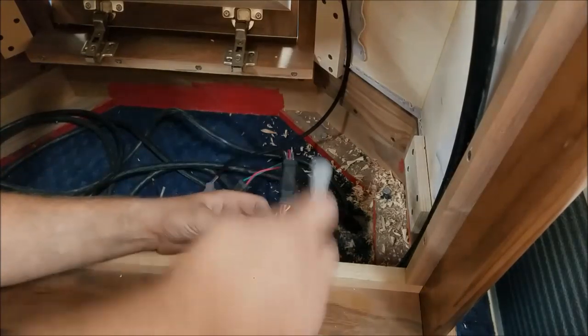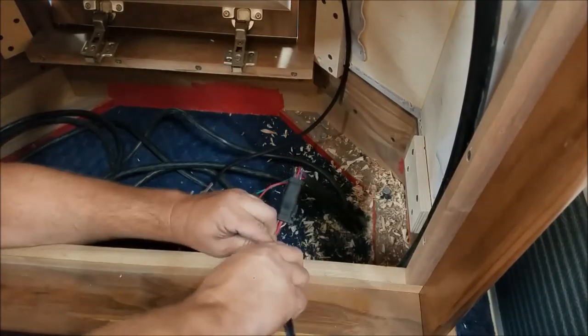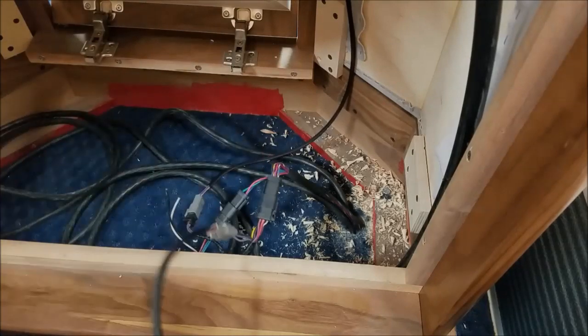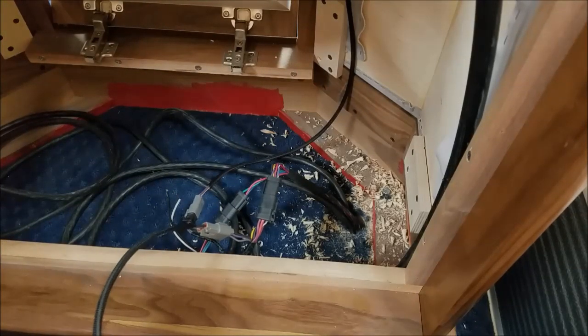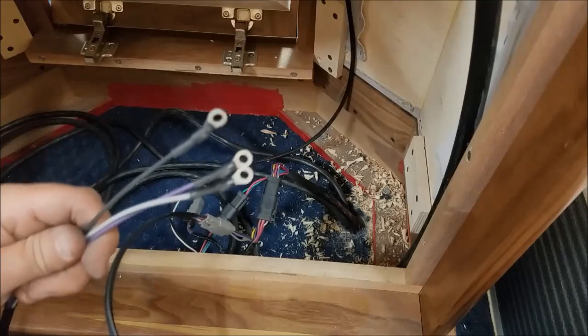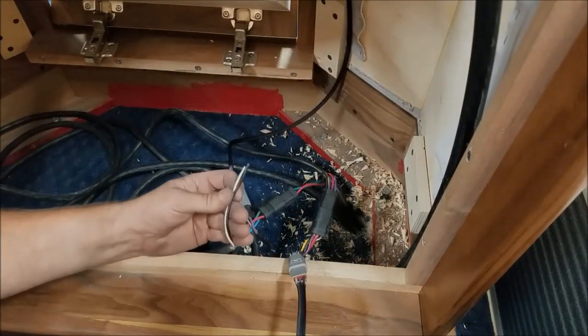Alright, the tach harness, the most important one here, I think, is connected and made and ready for service. Wires going in the correct order. The other end of the harness looks like this. Now, if you have a Johnson Evinrude and a tachometer harness, you're going to recognize these 3 wires. If you have a Mercury you still are going to recognize these three wires. The only difference would be you have these two built in as well.